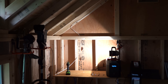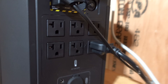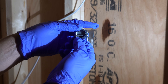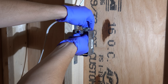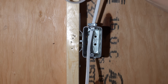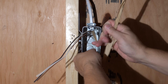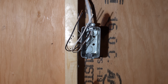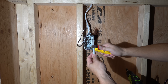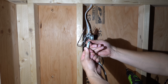With all the fixtures wired up, I now need a way to connect the solar power system to them. Those systems use regular AC outlets in the back, but my fixtures are all hardwired, so this box is going to give me a connection point to tie the two systems together. That top wire is feeding the fixtures and I'm using one of these special clamps to hold it tightly — this will prevent the wire from rubbing against the metal and possibly causing a short circuit. I also need a cable coming from the solar power system into this box, so I used a heavy-duty cord — in my case, a leftover extension cord cut a bit shorter — stripped the outer insulation and put it through the same clamp into the box.